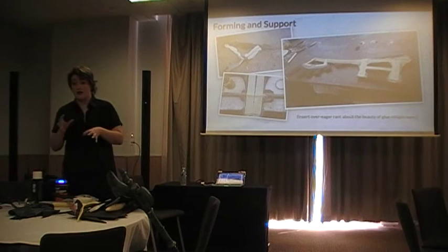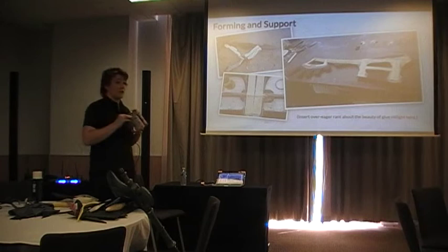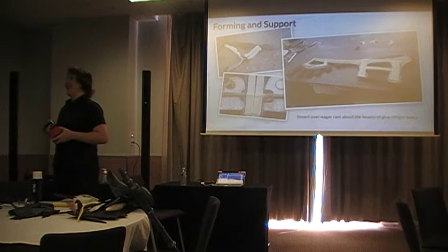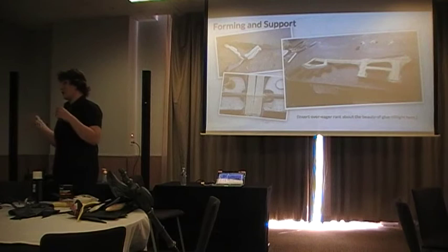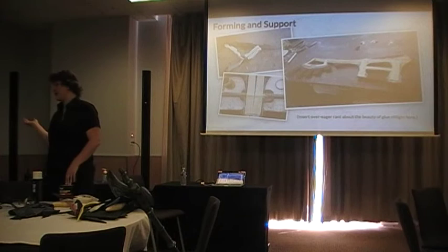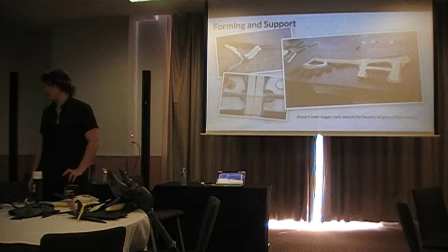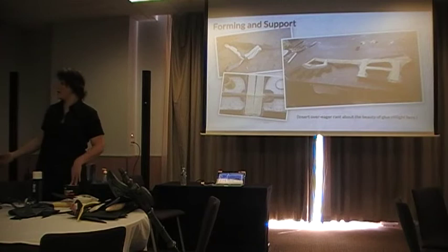So contact adhesive, usually you can make this stuff thinner with a chemical called toluene. If you are using toluene, have a mask. It's the stuff they use to thin diesel. I thought they didn't use toluene. Oh, they use toluene. There are quite a few chemicals that sound like toluene as well. One did get discontinued, but several companies still make it, and I can still buy it on eBay. So does standard Evo-Stik still have toluene? Standard Evo-Stik is almost exactly the same chemically as every other contact adhesive. It's just the extra fillers they put in it. There's very, very little difference from contact adhesive to contact adhesive, and if you know how to thin it down, you can create the style of contact adhesive you like.